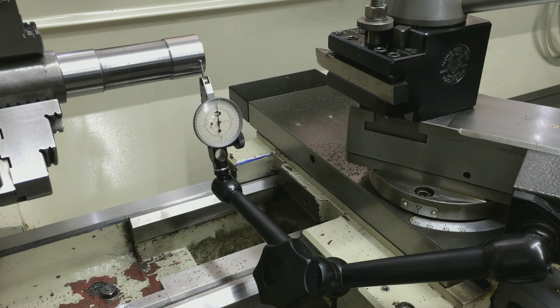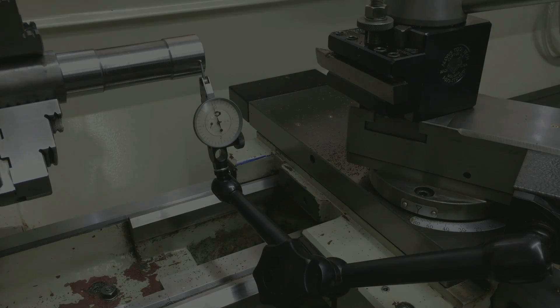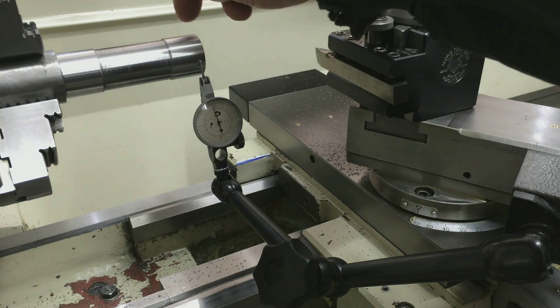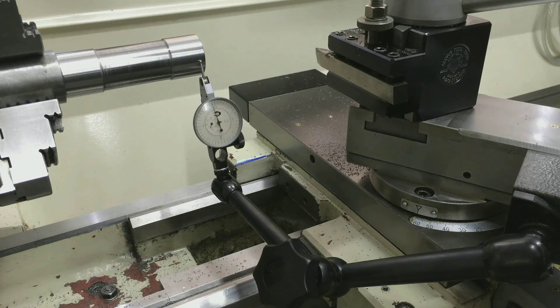Okay, that's not good — it's going in the wrong direction. I think I went beyond the fulcrum point, so let me reach back in and get to the other one. Okay, I got it to come back — I got my one tenth. So basically we're going to take down the indicator, make another skim cut, another measurement, and go back and forth until we have a zero reading on this pad and this pad. Then we're going to cinch down the bolts, torque them all the same, and make a skim cut and hope that we didn't change anything.